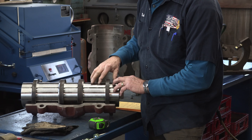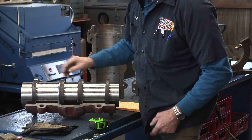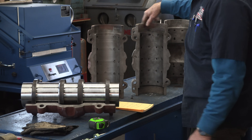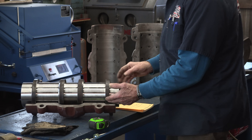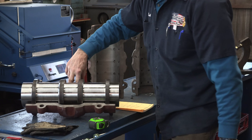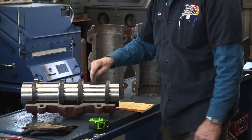We took our inner tube and bored four rings. We put an angle on each one of these so that they would come in close to the angle on the bearing, and these are square. Our mean radius on the inside of each one of these is six inches. A combination of how we put this in here with some asbestos-simulated wrap and stuffing fiberglass insulation down into here, then smoking the mandrel bore or tube, will allow us to pour these bearings.